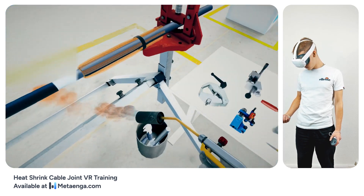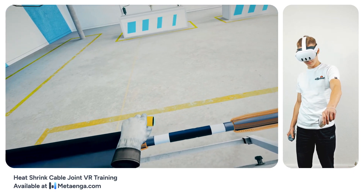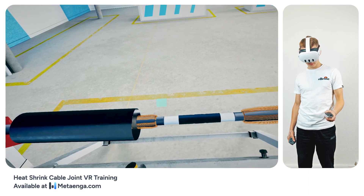To ensure proper stress relief in the electrical field, grab the RS-7000-25 stress control mastic tape from your workbench. Center and wrap one layer over the designated areas, aligning it with the edge of the semiconductor layer or semiconductor tube.